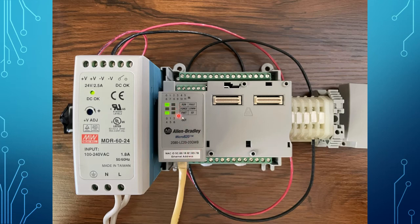The LEDs on the front give you the status of the Micro 820 PLC. On the left-hand side we have Run, Force, and Ethernet. On the right-hand side we have Fault, Communications (Com), and SD for Secure Digital — there is a secure digital slot in this PLC as well. The green light being on indicates the PLC is in run mode and has an Ethernet connection. If we had a forced I/O point, a light would indicate that. A fault light would illuminate for any fault condition, the Com light would flicker during communications, and the SD light would flicker for any secure digital activity.